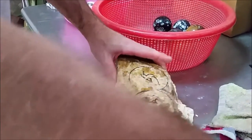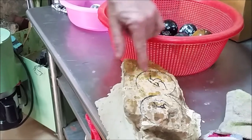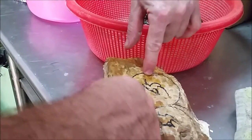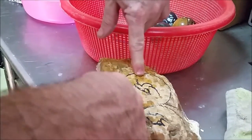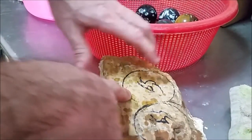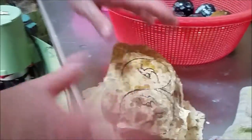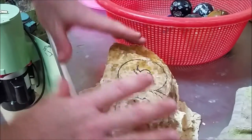If you're leaning like this, the bit's going to contact here first, and then the bit will slowly move out. And if you crank the speed up when you're right about here, you run a really good chance of the thing either grabbing and spinning or trying to flip over if it's a smaller piece.